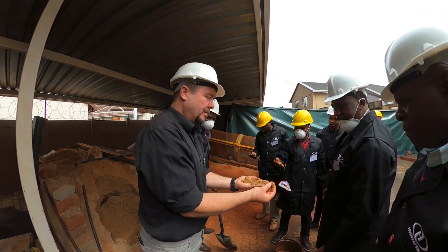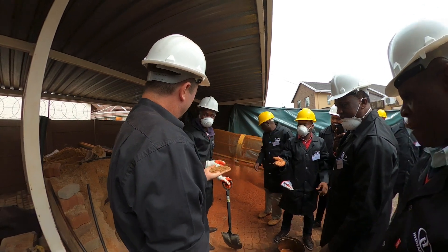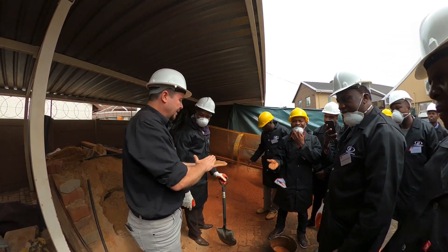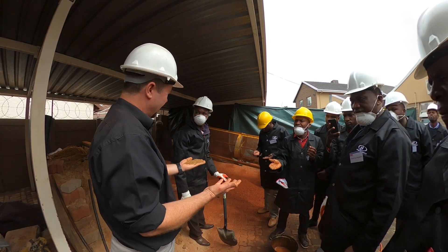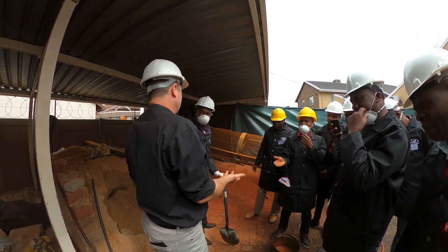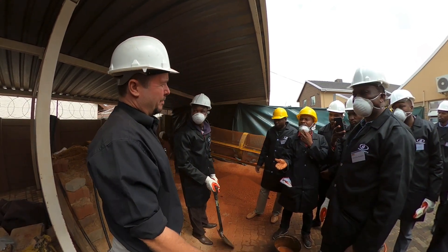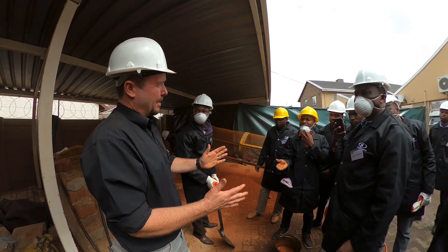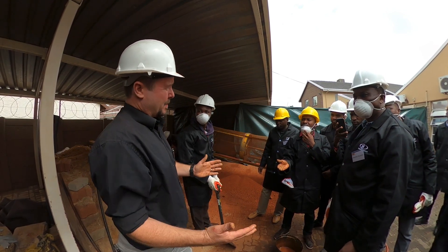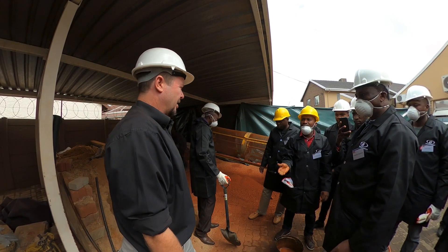You can see there's a stone in it. Can you use river sand? Yes, if your river sand is clean, because sometimes river sands have clay in it, so you need a river sand that is clean. What about beach sand? No, I would not recommend beach sand because beach sand has salt, and salt reduces cement quality. It affects your cement quality, so beach sand shouldn't be used.